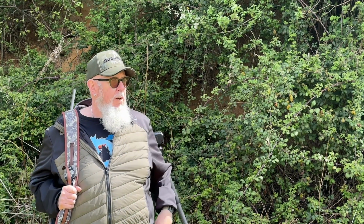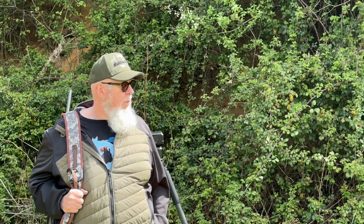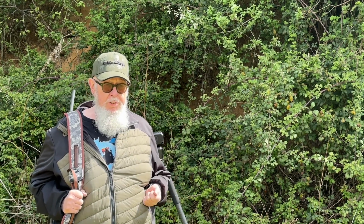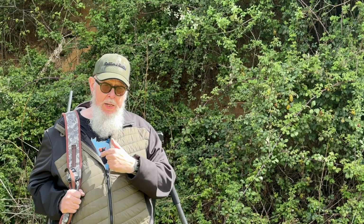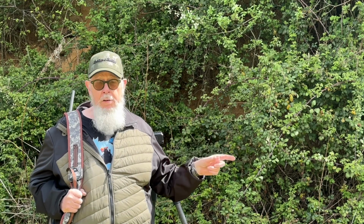And it wasn't long before firearms manufacturers saw this as a thing they could use to make money, and they decided to start producing box magazine lever actions, which up until then just didn't exist, because with a pointed cartridge you can put it in a box magazine for a lever action, whereas with a tube magazine, a pointed bullet can, under recoil, hit the primer of the round in front and set it off.